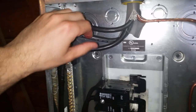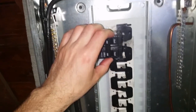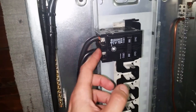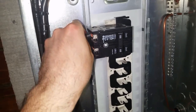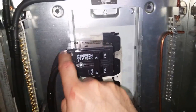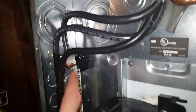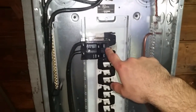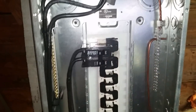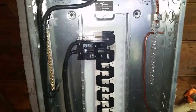This is the equipment ground wire. The two hot wires loop into the panel — leave enough wire in case you need to reconfigure things. Keep the red-stripe and solid-color cables oriented consistently so the top and bottom of the panel distribute 110V and 220V correctly. The neutral wire connects to the neutral bar and may require a lug. If you have more than six breakers, install a main disconnect. Always label every circuit on the panel face — that's per code. And always check your local town codes, as they vary.